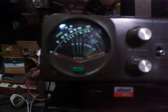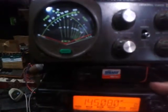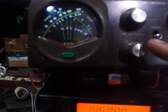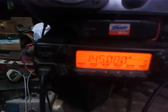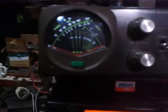I'm going to set it now. I'm using the 2-meter band and I am setting to 144 MHz. I will show you how it works — this is the TR matching and antenna matching. We have here an ICOM IC-2200 FM transceiver to test this meter. I am now on high power at 145.080 MHz.